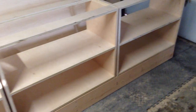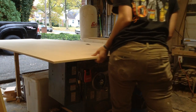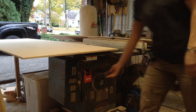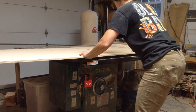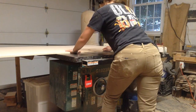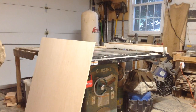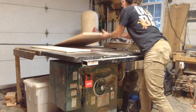At this point I'm going to cut all my backers — this is half-inch maple veneer ply. Because my fence only goes to about 26 inches, on wider pieces I end up cutting the smaller side first, and then I can cut the backer. This is not the safest cut — the edge of this is actually sitting on top of these cabinets, which worked out nicely because they were about the exact same height as the table saw. Once they were cut to length I cut them to width. Sometimes they will bind, so I stopped the saw instead of forcing it through and just cut the bottom piece with a handsaw. This is one of the reasons you'll see me wearing headphones — usually when using power tools the music is off so you can hear the tool under stress and take proper action.